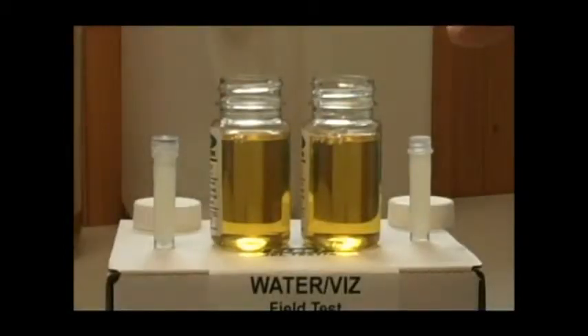What we're going to do is a side-by-side comparison. These are the same fuel we've added to two different tests. We're going to add one drop of water to this test on the right so we can see the difference between a pass and a fail. That's a single drop of water, about 30 microliters. I'm just going to shake that water up just a little bit.